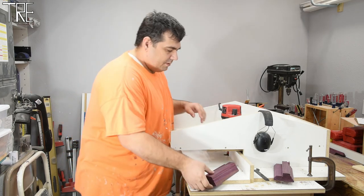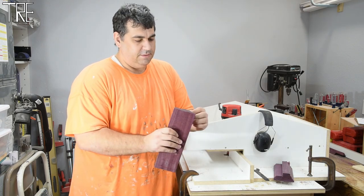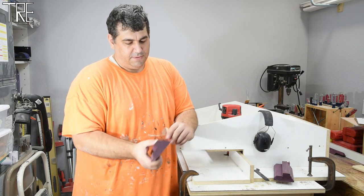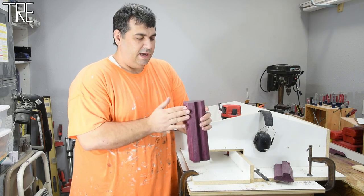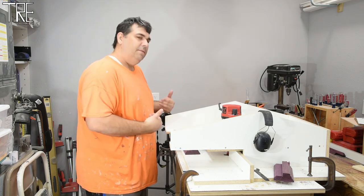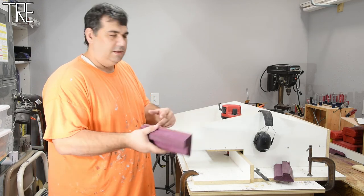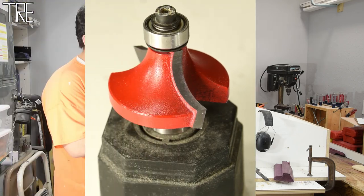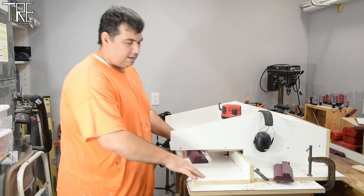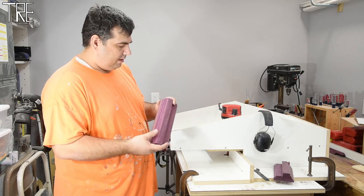After experimenting more, I found that for the full half-inch round over, I hadn't cut the OG profile far enough down to fully encapsulate it, and three-eighths wasn't big enough. So I'm lowering the chamfer and then the OG to get the right clearance. The gantry is now set up correctly — fence behind, moving left to right since the router is inverted — which throws debris away from me. I cut my long piece into two halves since a 60-inch piece was a lot to manage, and made some modifications to fit the router bits.